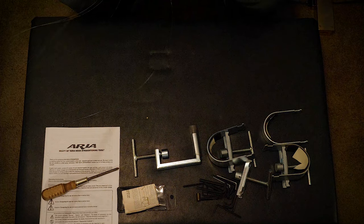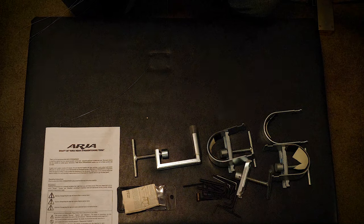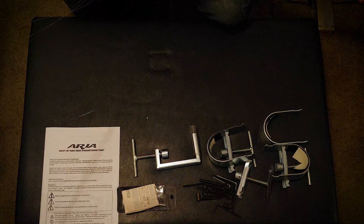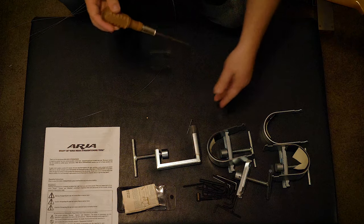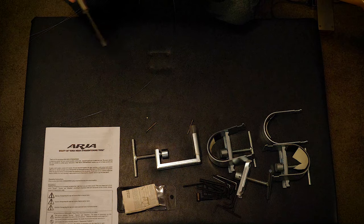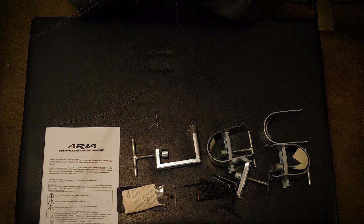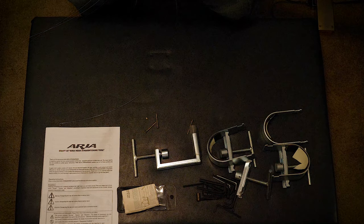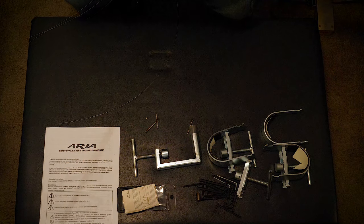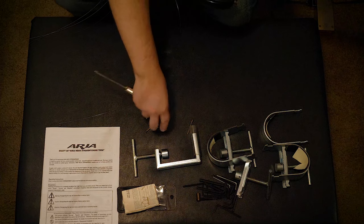So I'll have to take the neck off to put some amount of strain on the truss rod so it is being used. Before it was bottomed out, whereas this let it kind of allow the neck to reset. What is it 5, 10, 20 years later? How's the neck gonna be? My guess is that straight wood will stay straight, where slightly curved wood is gonna curve back again. So I think this is kind of like ironing out clothing. It's gonna help for a while, and it's gonna play awesome and be great. Then after a certain amount of time, it probably would be nice to do this again.